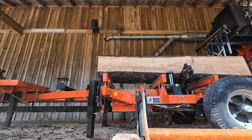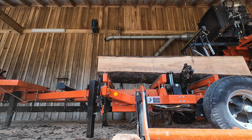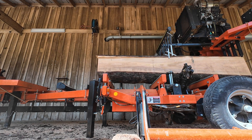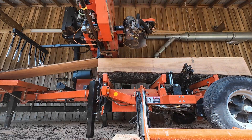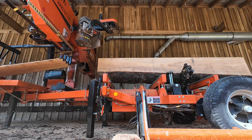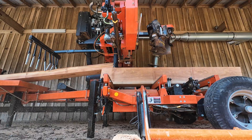I'm going to pick up some clips from a few other videos to show you just how much manipulation you can do and how the technique is important to get the board to fall and land on the edge. Basically, it's a double bump. You go up to the boards you've just sawn, kick them loose, break the stiction — which is sticking friction — then get them sliding. Just as they're about to see-saw off the front of the cant, pick them up with the shoes and start coming back smoothly. Once you've got them on the ledges of the shoes, if at any time you want to drop that board, you stop the head and the board's momentum will carry it forward and it'll drop to the deck.